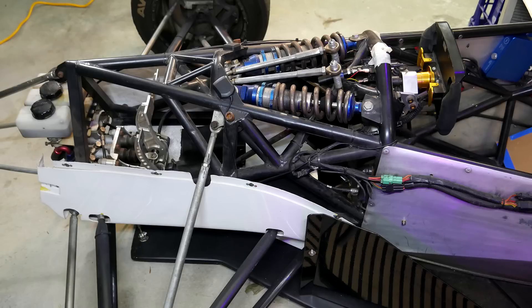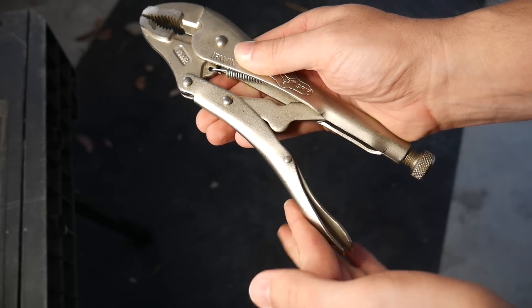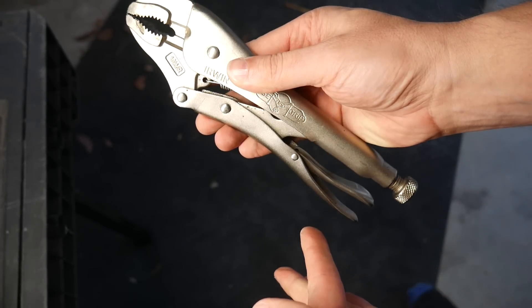Let me explain the plan with a side view of the cockpit. The green line shown here is the default position for the brake pedal, and the aim was to make a pivoting artificial leg that rested upon it. Just like a human leg, when it extended straight, the pedal would be pushed in. And like any other over-center mechanism, when it pushed just past center, the leg would keep wanting to bend that way — so if we could prevent that, it would lock into position. Just like how vice grips go past the tightest point and then lock the other way into position.